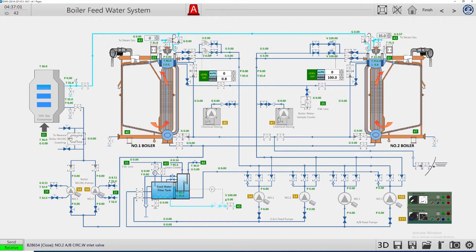This inlet is from the exhaust gas economizer — we need to prepare this line too. Let's trace this line to see where it goes. Here is the blow-down line: top blow-down and bottom blow-down — we won't use it for the moment. Here is the boiler in service, and we'll open the water circulating pumps.